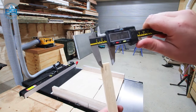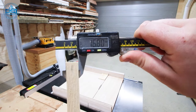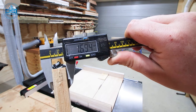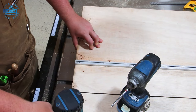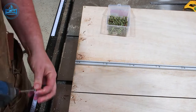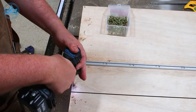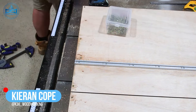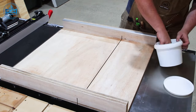Once we completed that again and checked our numbers, the error over a full meter was less than 0.15mm — pretty happy with that. Once you're done, go ahead and countersink and screw off your front fence. Just remember not to use any of the holes you used when moving your fence, otherwise it's going to move it out of alignment. Drill all new holes and bang in a whole heap of new screws. Make sure you don't screw anywhere near the blade — you don't want to damage your saw blade.